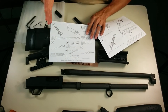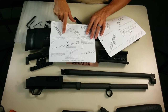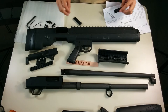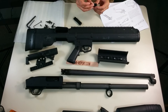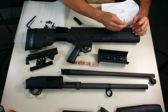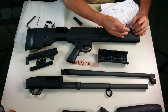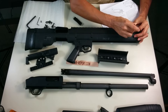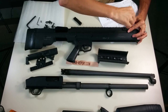If you watch the installation video at BullpupUnlimited.com, they actually put these rail pieces on later. We're going to do it now as stated in the instructions because it's held nice and steady while assembled. We're going to use these little machine head screws. The instructions say there are 12, but there are actually 11 — that was a misprint. So if you're looking for your last screw, there isn't one; there are only 11. Getting them tight but not too tight.